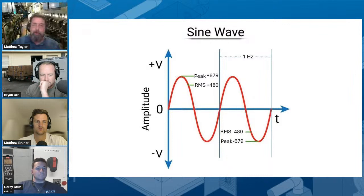We don't see plus or minus on our meter because the true average of a sine wave is zero — and that's not useful. If your meter reads zero volts, you're probably about to get shocked. When we're talking about a Hertz, we're talking about one of these complete sine wave cycles. In the electrical world, Hertz is how many of these cycles occur in a second. At 60 Hz, we have 60 of these cycles in one second. That's what we're going to be manipulating later.